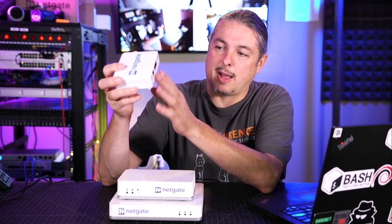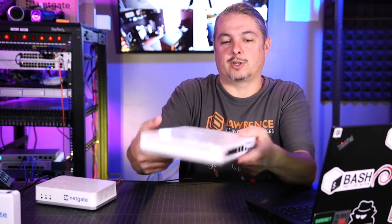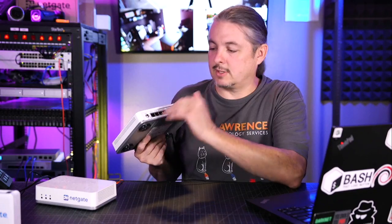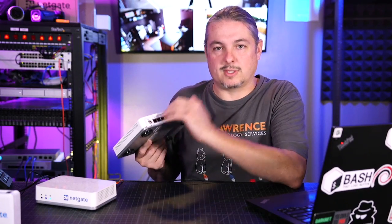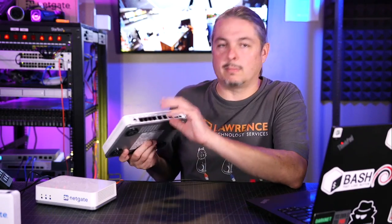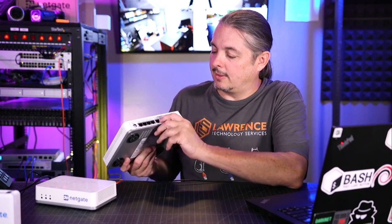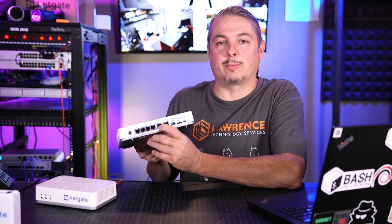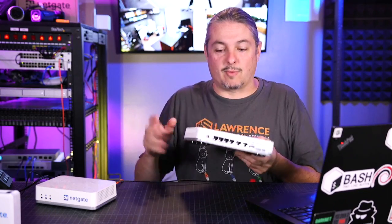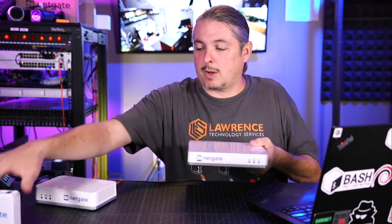The other limitation is we've only got three ports on here, configured as three logical ports out of the box. Then we look at the SG3100, which has four ports — essentially one logical port but four ports as a switch. So we've got switches and VLANs, an ability to do some custom configurations without needing to buy a switch. There's also the WAN port and the OPT port, configurable for failover mode. That's a great option at $399.